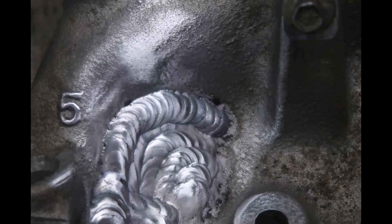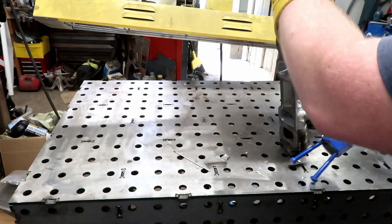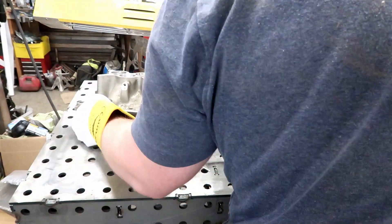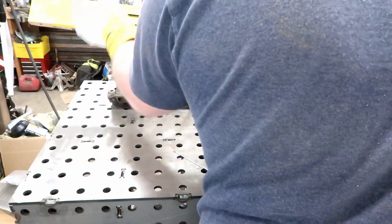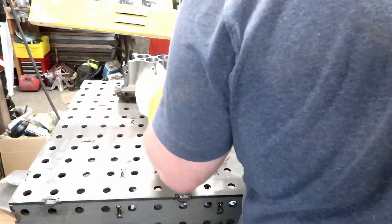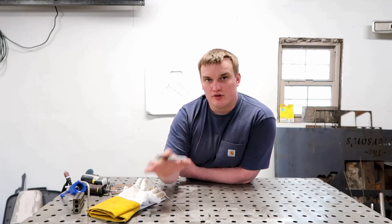And here is the final product. After you get your weld done you want to go right back under that heat lamp, or out in the sun, or into a lightly cooled oven, so that it will not cool off too fast and you'll minimize any cracking or delamination. It didn't go too bad — you always strive to make it better but it's definitely acceptable and will hold together just fine. I set it outside to let it cool down. Put it under the heat lamp for just a little bit and then set it outside in the sun.